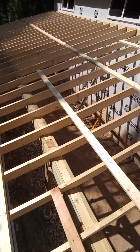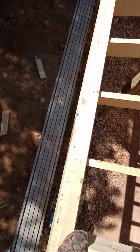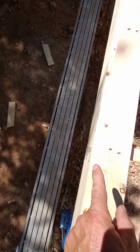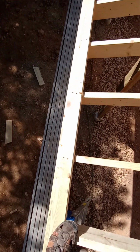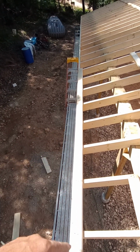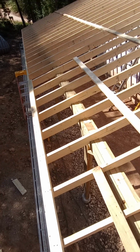Oh, there was something else too. This bottom board has got a plane out. It's not right to the edge. See, it's in about 3/4 because you want that to plane out, because when I do my flashing, it's going to go down and over my fascia. I don't want this top run holding my drip edge way out over my fascia. It looks stupid.